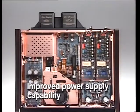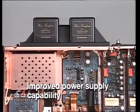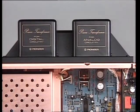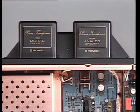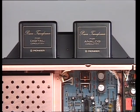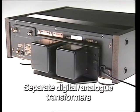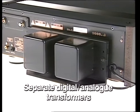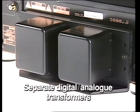When it comes to the power supply, we put special emphasis on providing our CD player with abundant power, so that the sound it provides is rich and balanced. To ensure a steady power supply for substantial bass, the power supply uses a discrete push-pull design and features high-capacity transformers. Furthermore, there are 2 independent power transformers, one for the analog circuits and the other for the digital servo circuit. This elaborate design eliminates unwanted interference between the two sections.